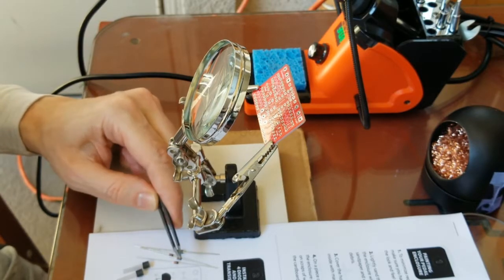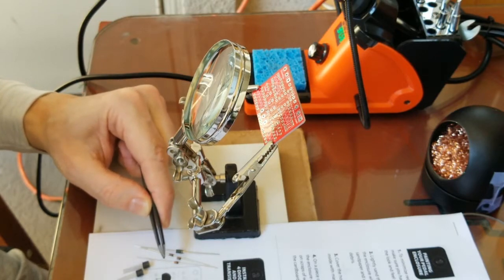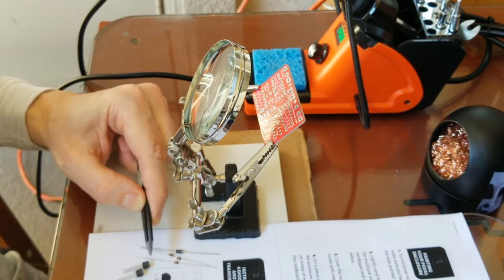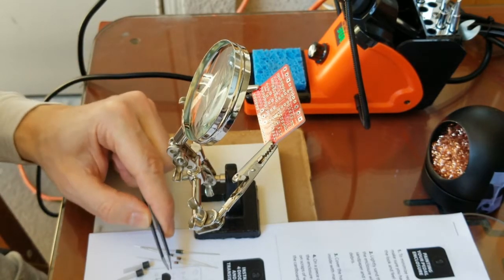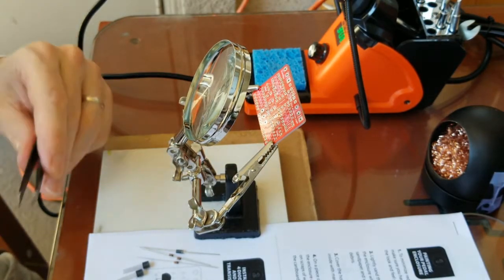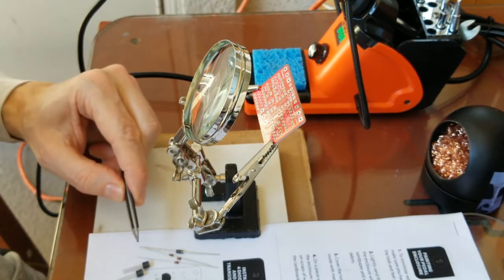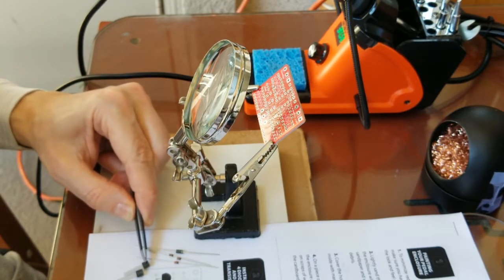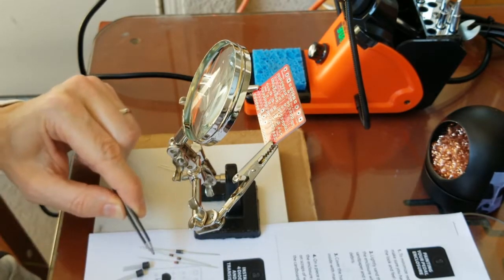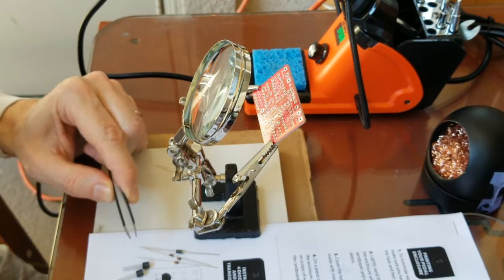So for example, just for argument's sake, let's say you strum your guitar and that sends a signal through the pickups out through the wire into this board. Well, that guitar current, the signal coming through that guitar pickup, is very small, but it could be just enough to open the switch here and allow the full 9-volt battery or 9-volt power supply current to pass through the transistor.